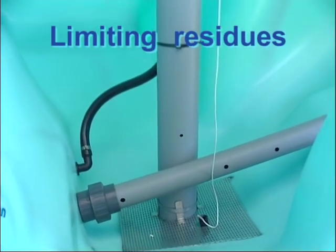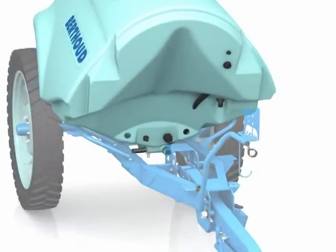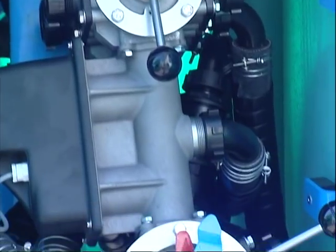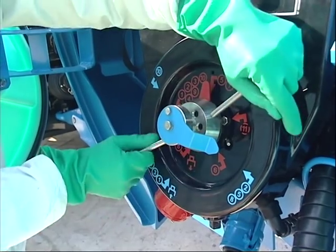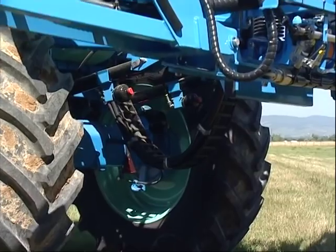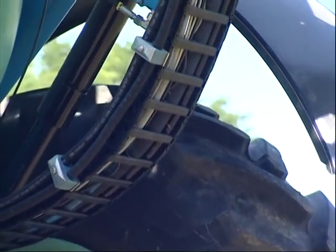This reduces the risk of overflow and allows exact control of the volume in the tank. To keep residues to a minimum, the main tank interior has a diamond-shaped bottom and a sump with a side drainage pipe. The Dualmatic has been designed by Berthoud to limit residues by reducing the number and length of the hoses. The spray lines, routed through a guide, are shorter, better protected and more accessible.